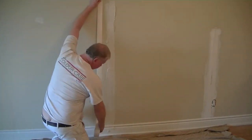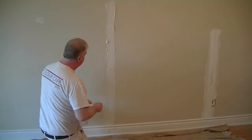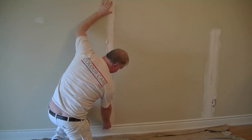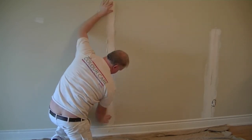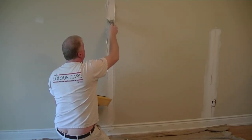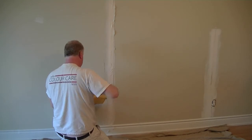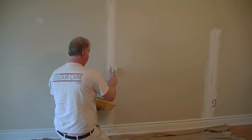That's the mud coat for the paper tape. Just roughly measure out how much tape we need and tear a piece off. Press that in, and you line up the crease of the tape with the joint and press it in by hand. Then you take your knife again and come down on one side of the tape, and then the other, about halfway down.